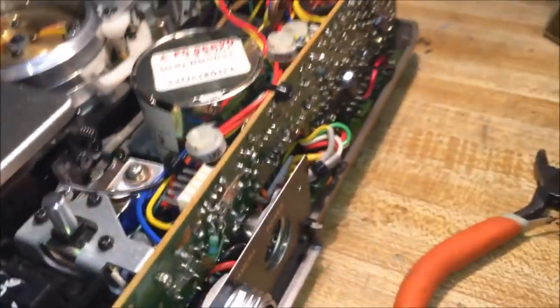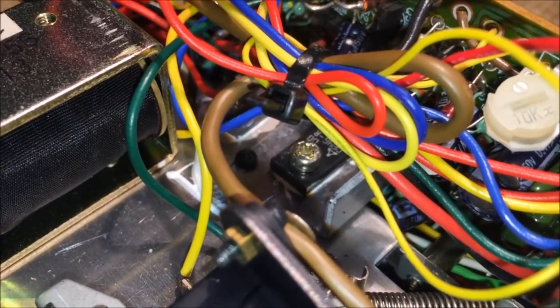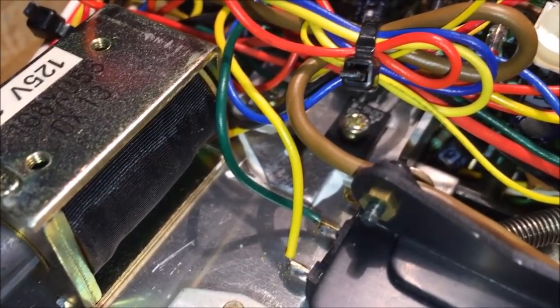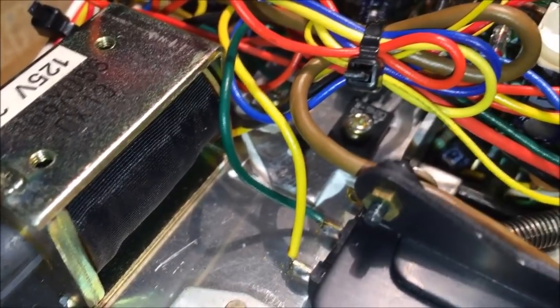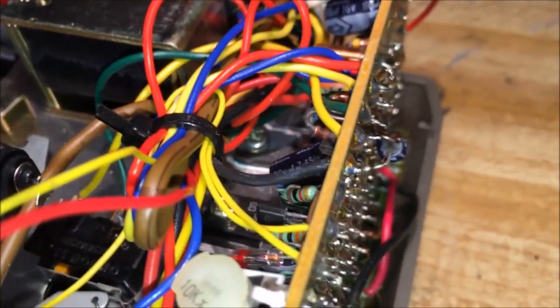After doing a little prayer, meditation, and looking at this thing, I came to the realization that the reason the rest of the mechanism isn't working is because of these two transistors in here. There's one of them — it's right in the middle of your screen with a screw on top of it. I actually took a flathead screwdriver and put it across the two pins on this side, and the loading mechanism — the threading mechanism — took off. So thanks to Gateway Electronics here in St. Louis, I was able to pick up the replacement transistors.